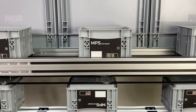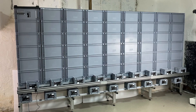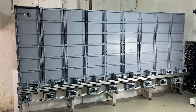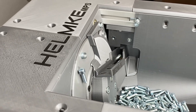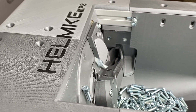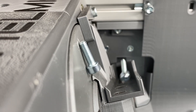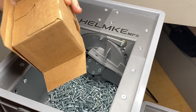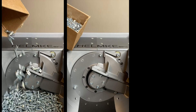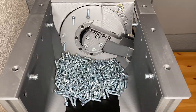In this video we will use 3D printing to build an inexpensive conveyor belt for the MPS. During the last years I've manually packaged and counted thousands of different screws, nuts and washers — all for 3D printed parts that I sell online. So I used 3D printing, PCB design and other processes to build an automatic screw counting machine. The design is based on some fundamental principles and it is parametric, so it should work for a variety of conveyed parts.